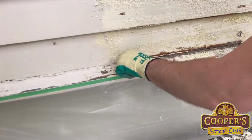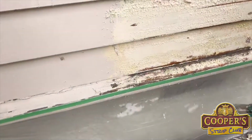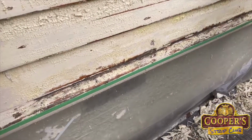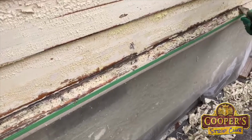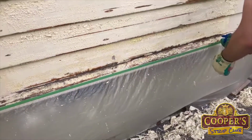When you fill up all these natural draining areas, it's a good way of getting moisture where it shouldn't be. I mean, moisture comes down, the tension's broken and then it flows off. When you fill it all up and then paint it, it's a place where moisture will go in and sit.